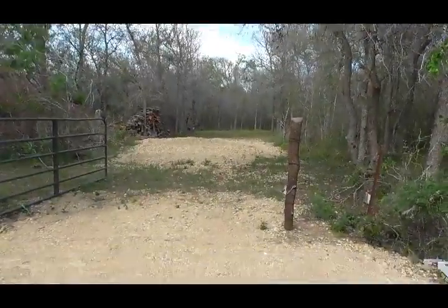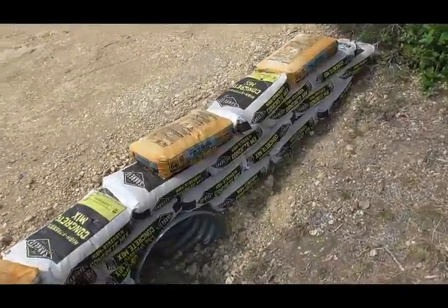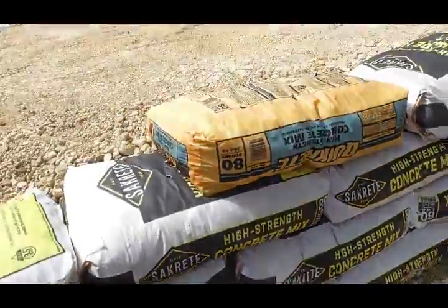And this gravel, the dump truck, when he came to deliver that second load right there, sunk in like between 8 and 12 inches, and actually right about here put a little dent in the top of my culvert, even though there was about 12 inches of gravel on top of it because I hadn't compacted.